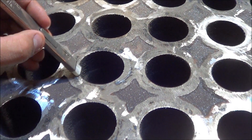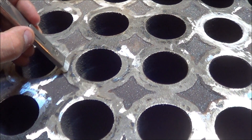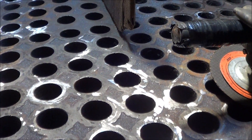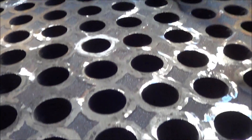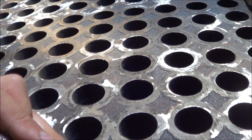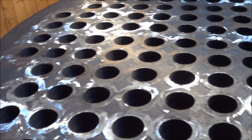Once we reach the tube plate we know we've gone far enough — it's ready to come out. We move on to the next one and repeat that process two hundred and ninety-three times. It takes a long time because these welds were thick; some are not quite half an inch but probably three-eighths, somewhere around there — some pretty thick welding going on up here.